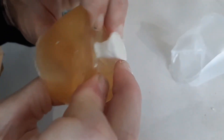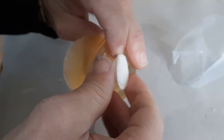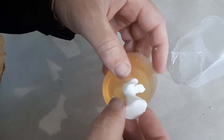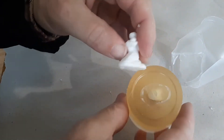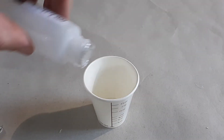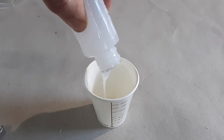Now I just pull off the plastic cup and push out the original master part. I use my thumbs to push from the bottom and that pops it right out. The awesome part about the composite mold is after I pull this mold out, if I like it I can continue to reuse it as many times as I want, or I can remelt it and make different shapes anytime.